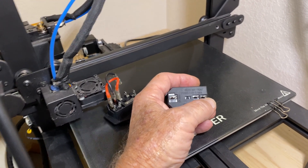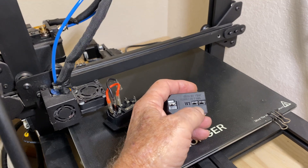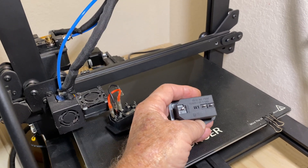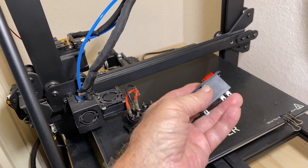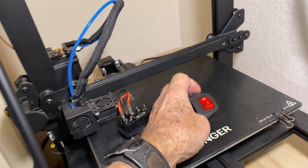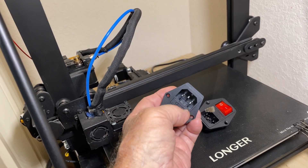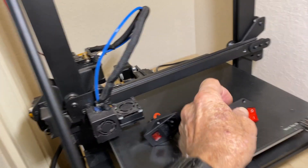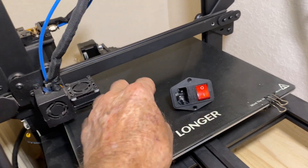This one here is the line, or the black wire. On a 3D printing machine the neutral could be any color — you never know what they're going to use. The line wire generally is black, but I'd always double or triple check before switching wiring. The black wire should be your line wire to feed the machine. Your plug pushes in here and everything else runs off the back. They also improved the fusing — the original had a fuse cartridge that's really hard to deal with, and this new one is a little bit larger but still fits in the same hole with the same screws.